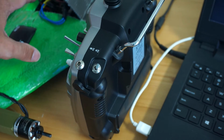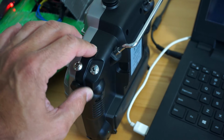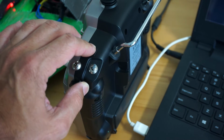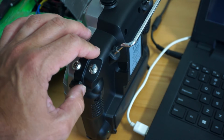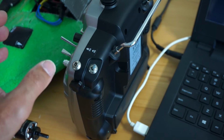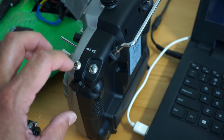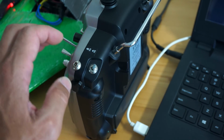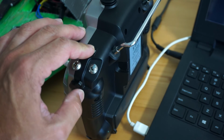And you could hear both the beep from the Pixhawk buzzer as well as Mission Planner trying to talk to us. And then I'm going to go ahead and bring this all the way to the top. And you can hear that it doesn't engage until we hit the midpoint. Just so if you're tuning a parameter really high or really low, you don't want that to take. So you need to send it to the midpoint, then you can go down or up to set your value as you test in the air.